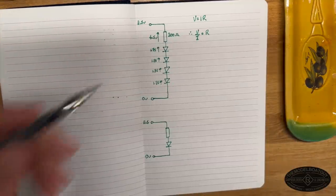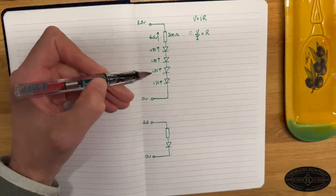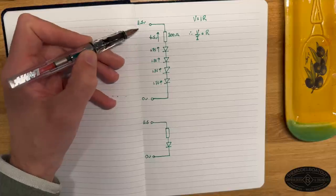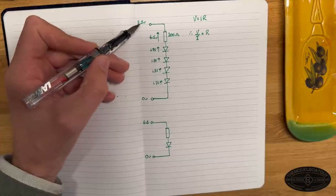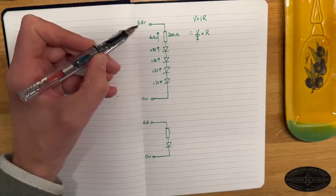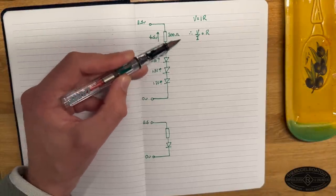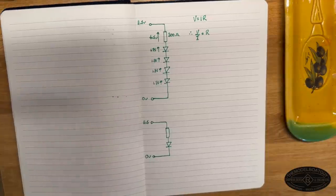And the way this works is that the resistor essentially eats up 4.5 volts, and each of the LEDs sees around 1.75 volts, and that cumulatively gives us the 11.5 volts that the circuit is supplied with. Now, my batteries do give out 12 volts, you're correct, but remember there's a power supply in between the batteries and all of my lights which takes the voltage down to 11.5 volts. So, that's how it works, and I deliberately specified that resistor to be 300 ohms in order to limit the voltage across the remaining LEDs to 1.75 volts.